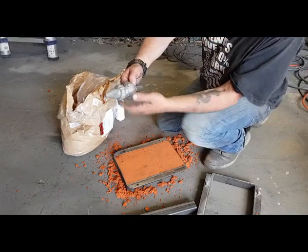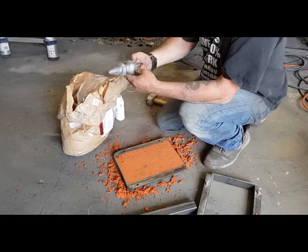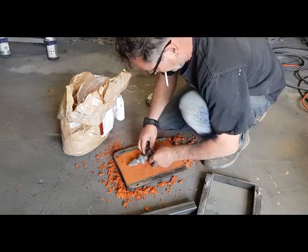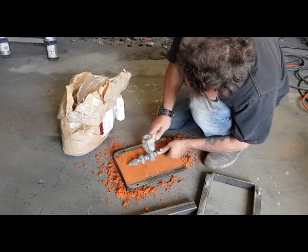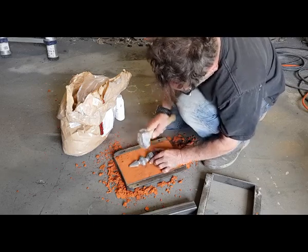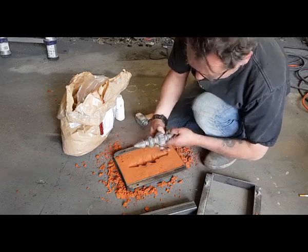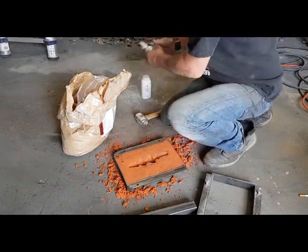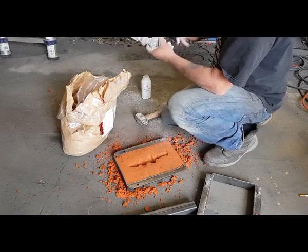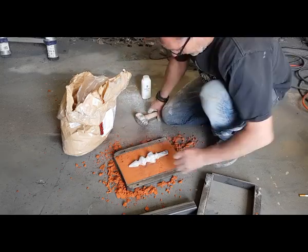Looking at this railhead, there's actually a parting line where you can see where they did this hundreds of years ago, so we're going to keep it the same. We'll line it up like so and tap it down halfway. You want to sprinkle this with talc powder — it prevents the sand from sticking to the part because we're going to need to remove it later. Coming back down to the parting line, we'll tap it down halfway.